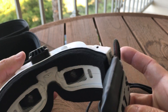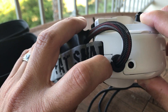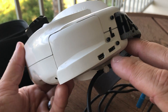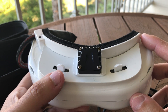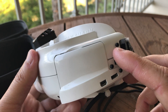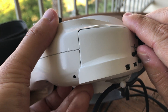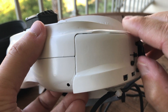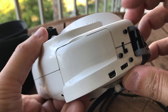The circuit board driver for the optics module is actually in the ear cups — the battery is on one side and the main circuit board is on the other — so those wires were clearly not designed to be moved around a lot. I had to figure out a way to manage them self-contained inside the shell. The battery was the only robust wire; I put it in shrink wrap with a little wire wrap and a grommet to go into the side of the goggles. It's still the stock Glyph battery, still charges off the stock USB port. I eliminated most of the Glyph buttons and only kept a three-position power switch, similar to the original, which also shows the battery charge level via LED.